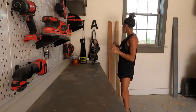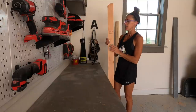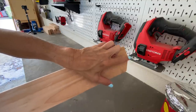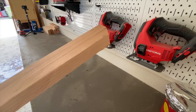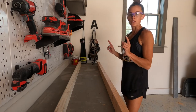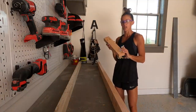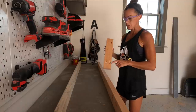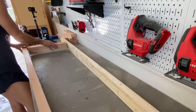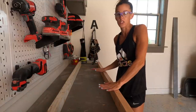I'm starting with the ladder. It's just two by fours that I've ripped to three inches wide. At the top I cut a 30 degree angle from the halfway mark down on both ladder legs, with those mitered corners facing up. I've also cut six rungs — they're 14 inches wide and I drilled one and a half inch pocket holes on each end. I'm going to refer to my plans to see how far I need to space them and attach them with two and a half inch pocket hole screws.